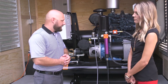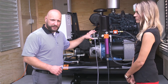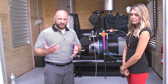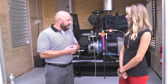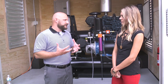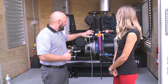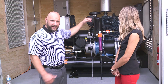This is a fantastic system — it gets the air down to very low dew points and relative humidity comes way down. The way this saves you money is by increasing your yield. If you're pulling moisture out of your system, you're potentially increasing your yield — less moisture going into the substrate. It's also saving your equipment, because equipment likes dry, clean air. That's the purpose of the filtration, the water separators, and the oil coalescing filters. After this, it runs into the trailer where everything is regulated.